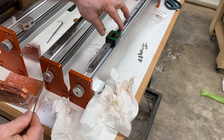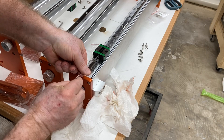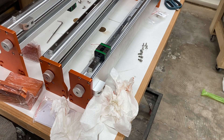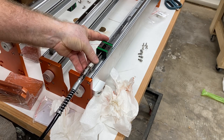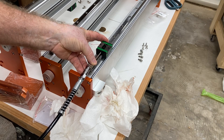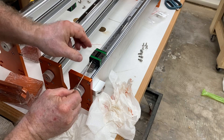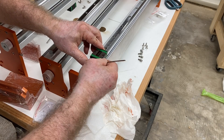Now this next part is not in the instructions, but it's something I like to do — you need to grease these bearings. There's a little screw on each end of these bearings; take it out and add a little bit of grease. I'll put a link to the grease I use in the description below. I have a little needle valve attachment that goes on the end of the grease gun, and I can slip it directly into that hole to apply the grease. These bearings need to be greased at roughly a 200-hour increment to keep them running smoothly.